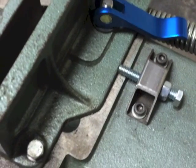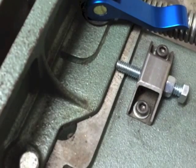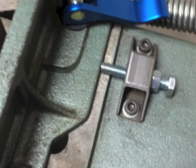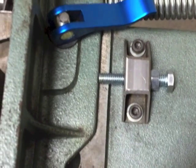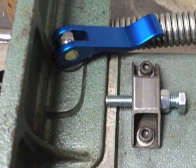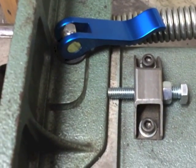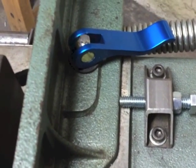So I had to come up with my own. It works — it's just not very elegant. It's a piece of square tubing that I cut and drilled and tapped a couple of quarter-inch holes to hold it down, and then there's a 5/16 bolt through it. I know the walls aren't very thick, but really it's just a stop — there's not a lot of torque on it, so I think it'll be fine.